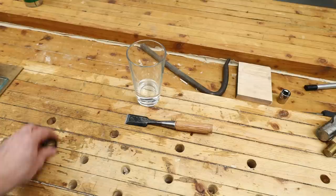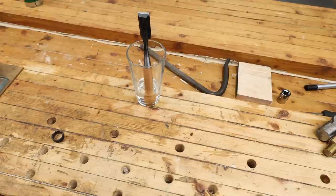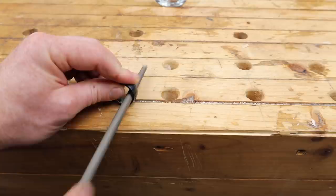I need to soften up the ends of the wood fibers so I can mushroom them over. We're going to leave the handle sitting in that glass of water for about half an hour and come back to set the hoop. In the meantime I'll do a small bit of work on the hoop — just work the top side of it to make sure it's going to sit down over the end of the handle.